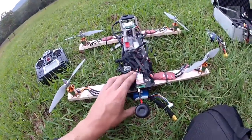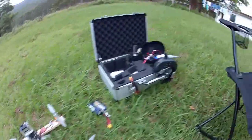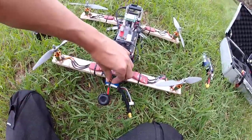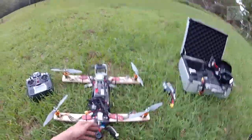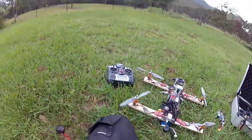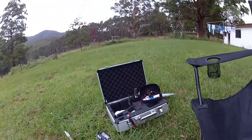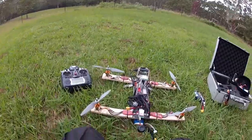The final piece of the puzzle is my 600 milliwatt Immersion RC 5.8 GHz video transmitter and my 5.8 GHz Fat Shark goggles for FPV flight. The 5.8 stuff with the circular polarized skew-planar antennas — these are the Spironet Version 2 antennas. I've pushed them 2K and still had a reasonable link. If I want to go further, I could probably hit 3K if I updated my receiver in these old Predator 1 goggles. I've actually got some -90 dBm receivers that I'm using to make a DIY diversity setup, which I'm going to post a video about very soon.